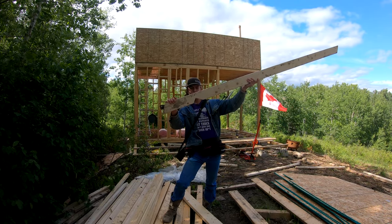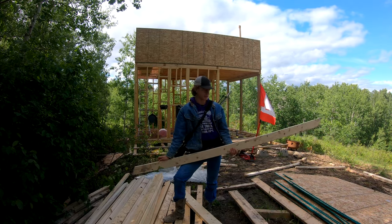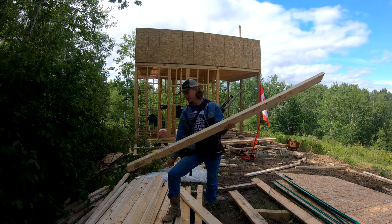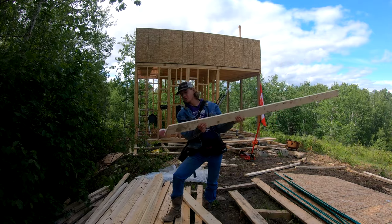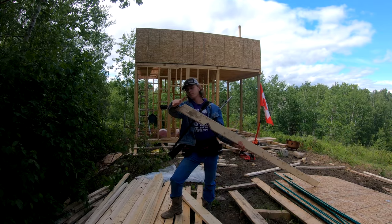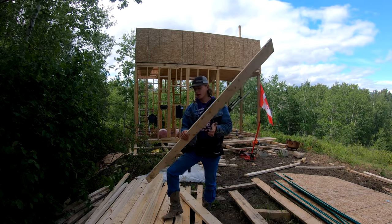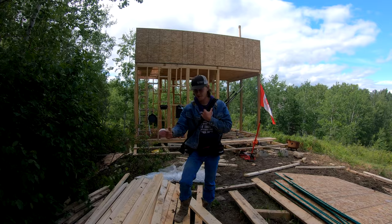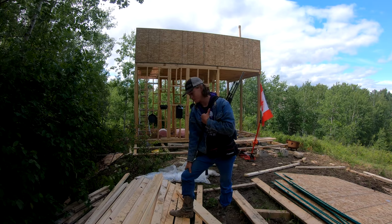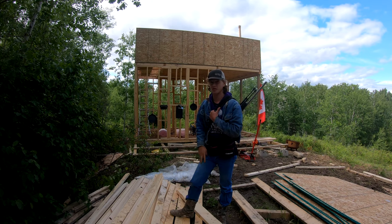I also cut my bird's mouth — don't ask me how, it was a guess-and-check trial-and-error process. After just one buggered up rafter, I got her figured and it's sitting in there pretty good. I also cut that same 35 and a half degree angle onto the tail of the rafters so I can bolt my end boards onto that. Now these are only 2x4s — a lot of guys will use 2x6s, whatever. This is a very small cabin and I'm not the royal bank. The more aggressive the pitch of your roof is, the stronger your rafters will be.